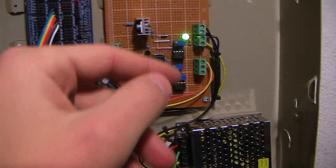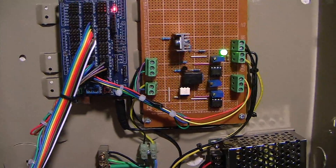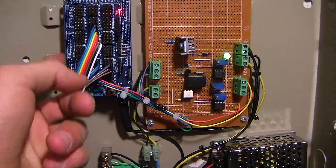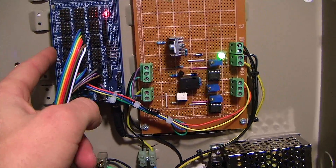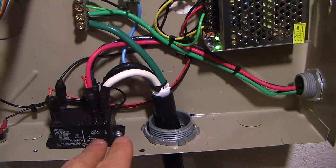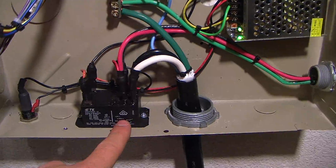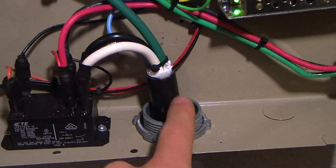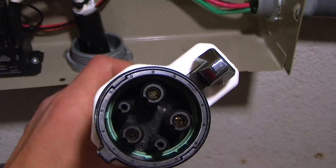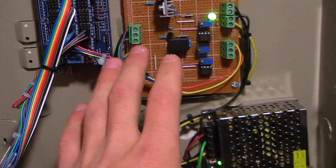This is all some custom circuitry I made myself — just some prototyping from when I built it. This here is an Arduino Mega board with an I/O shield on it. It's got a program I made in Arduino — this is the heart of the whole thing, the brain, the microcontroller. The big relay here controls the power that goes to the car. It closes and makes a connection and gives power to the plug only when it's safe to do so and when the car needs it. There are a few pins on the cable: the two power pins, the ground pin, and also what's known as a pilot pin.